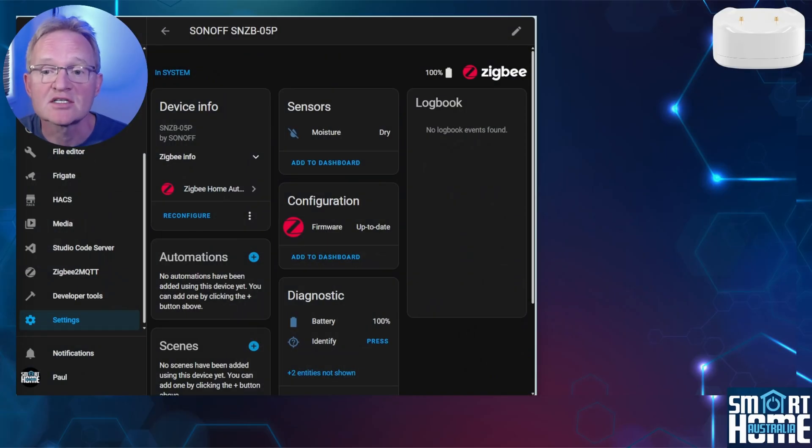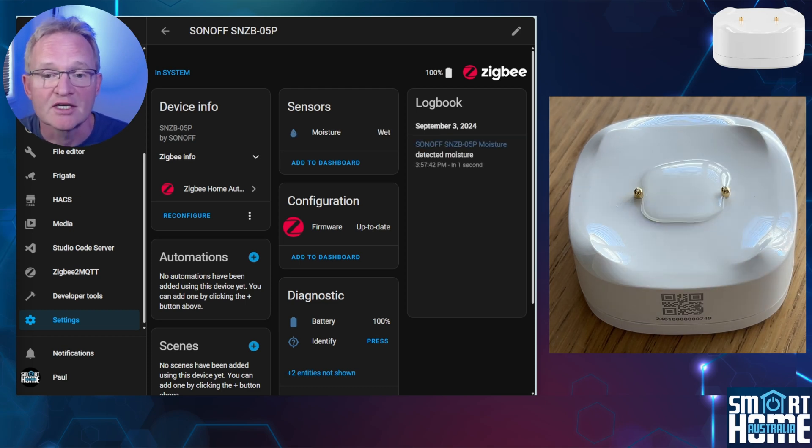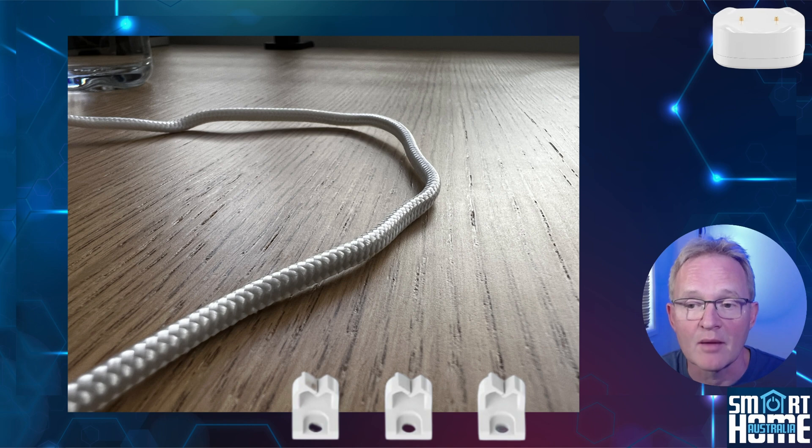When testing with the probes up, it takes a few drops of water to close the circuit for the sensor to turn to wet, but the response times once closed were virtually instant. Likewise when testing the device inverted, the amount of water needed to trigger the sensor can be more than other sensors. When using the detection cable you get the same instant response along the full 2 meters, and remember you can daisy chain these as many times as you like for great flexibility. The issue is that once the braided cable gets wet it needs time to dry before the state changes back to dry — I tested this at 24°C and 50% humidity and it took over an hour. The other issue is that being a braided cable, getting it to lay flat was a real challenge even with the included clips, making it more useful when wrapped around a pipe or held in place with weights.